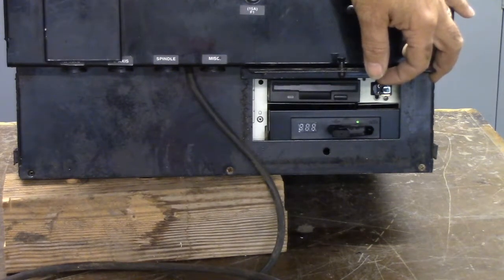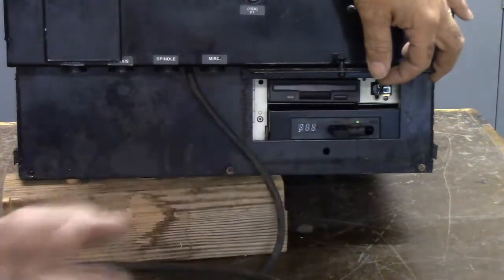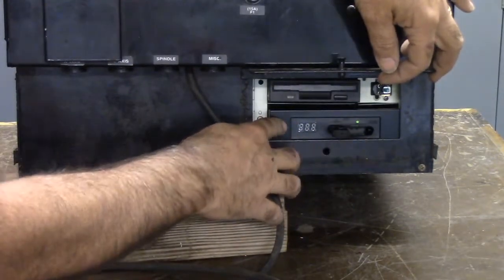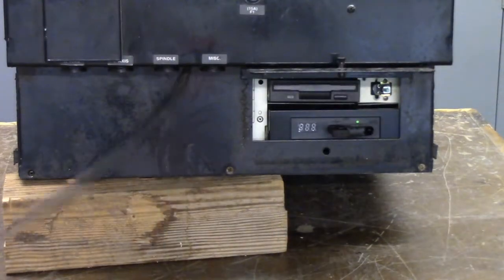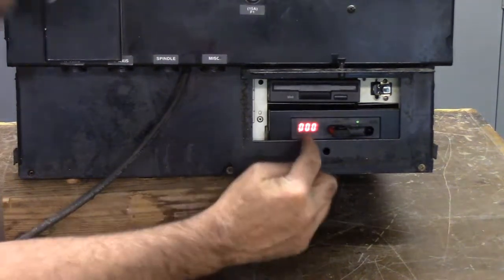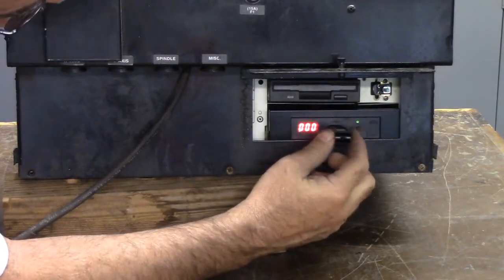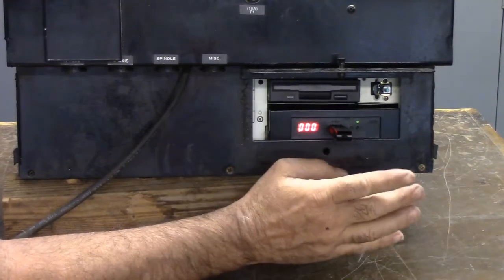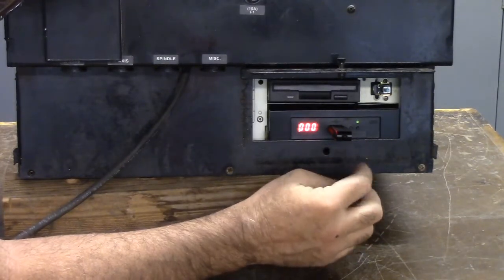The better software will partition this USB memory stick into 85 1.44 megabyte partitions. You can store your software in each one of those partitions. You might just leave it as one partition at 1.44 megabytes — that's still a pretty good size. The software on your Windows PC will partition and format the USB stick so the GoTek can read it. Again, I don't recommend using the built-in partitioning — use the software linked in the description below.